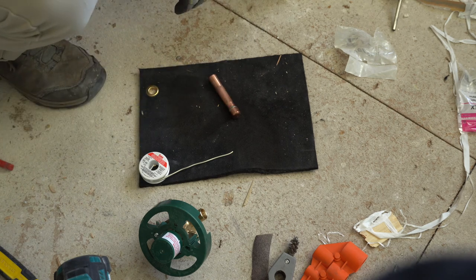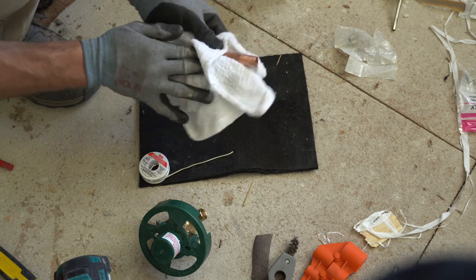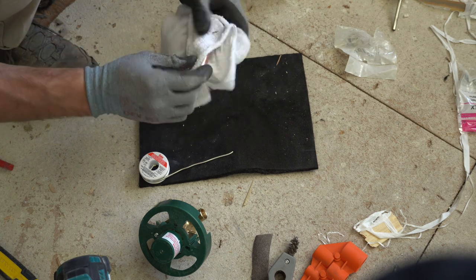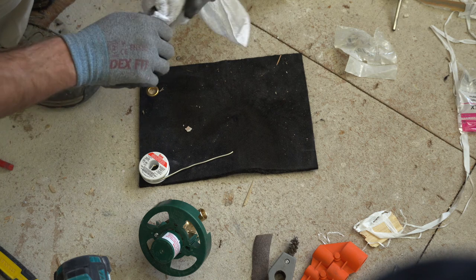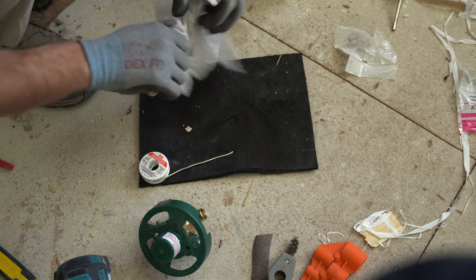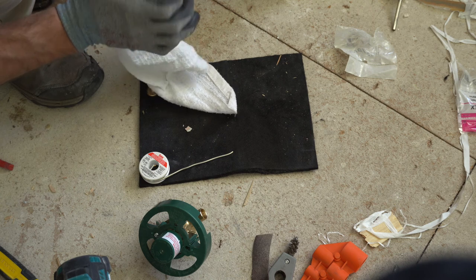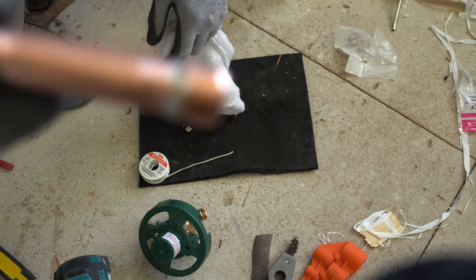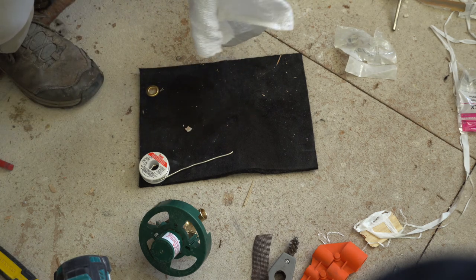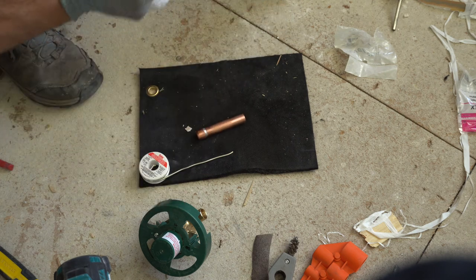Once you're finished, get a clean rag and wipe it off. You can wait a second or two for the metal to cool down a little bit, then wipe off all the flux. If you leave extra flux on there your fitting will immediately start to oxidize — it'll turn green like the Statue of Liberty. So clean it off real good. As you can see it's silvered all the way around; I'm pretty happy with that. Next we're going to attach this to the end of our valve.